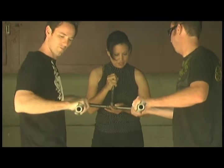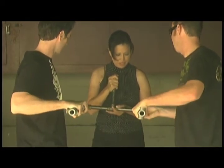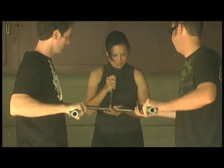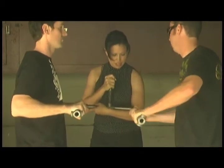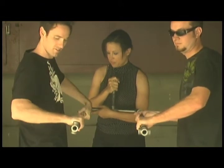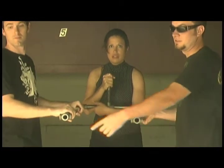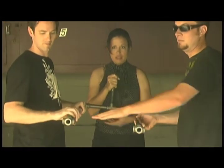So how is that in English? Your 1 inch by 3 foot pipe has a 3/4 inch nipple attached to the 1 inch by 3/4 inch reducer, which is screwed into the 1 inch by 3 foot pipe. And on the other end, closest to Luke and Ben, that goes into the tripod mount, you have a 1 inch to 3/4 inch reducer screwed into a 3/4 inch nipple that is then screwed into the 3/4 inch cross. Now that's a mouthful, but these parts are all listed on your schematic.